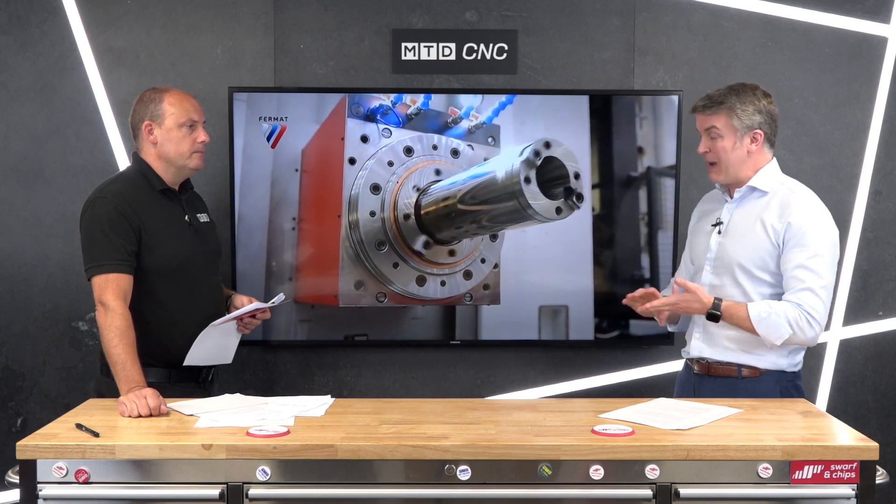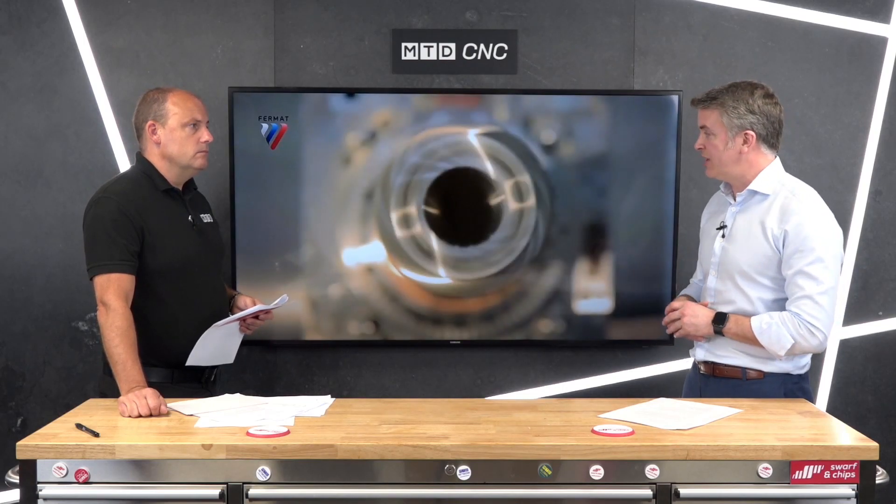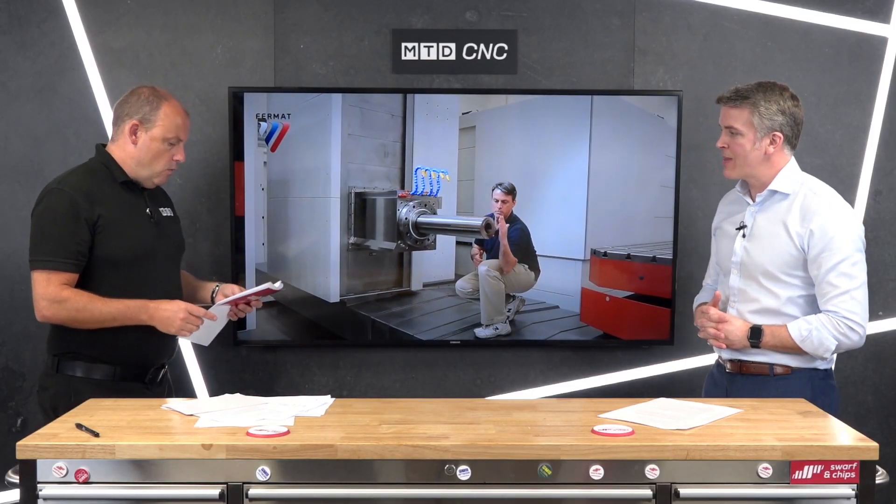They balance and test the heads in-house for long periods before they're allowed to go out with the machine. The design is modular — so if you're looking for a head that can move in 90-degree and 45-degree increments at 0.001 degrees at a time, that's available. If you need a higher powered head that only moves in one axis, that's also made in-house, no problem.